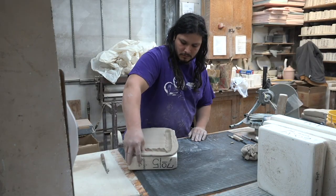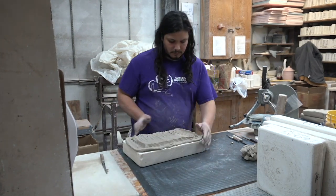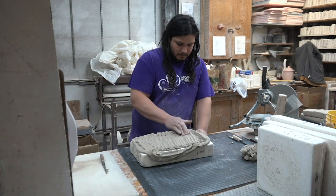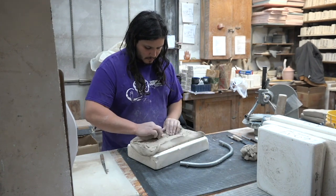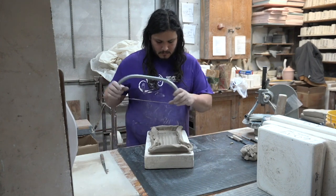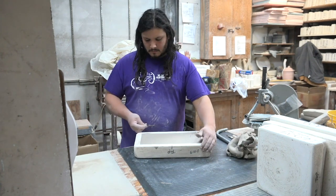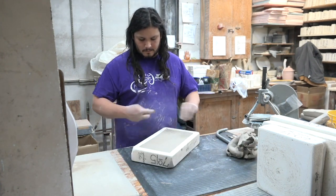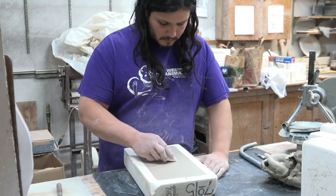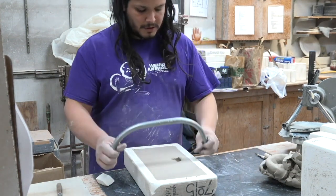They then push the clay into the mold using their thumb around the mold perimeter. Workers then use their fingers to press the clay into the mold. Next, they fold up all 4 edges of the clay into the mold. Workers next use the wire cutter to remove the excess clay. Then workers smooth clay using the knife. Workers then add the hanger area by pressing the hanger mold into the clay. Then they use the wire cutter to remove excess clay in the hanger area.